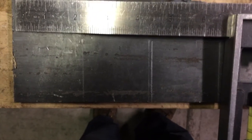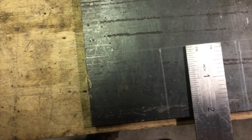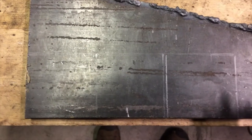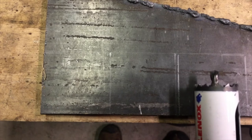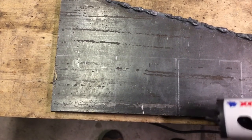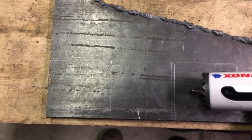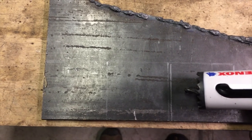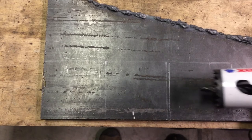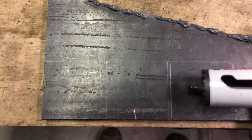Each one of these little squares is two and a quarter inches in length from this point to this point, and then from this way up here it's about the same — about a two and a quarter square each way. Then I'm going to drill using a one and a quarter inch Lennox bit. I'm going to drill into it so that the bit is almost in the center but not quite — just a little bit closer to this side — so that I'll only have a half inch of material. That will allow me to put a hook from a trailer anytime I need to attach safety chains. It's really just a way to attach safety chains that I'm going to weld on.